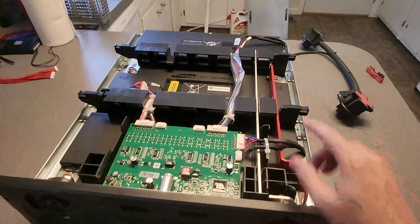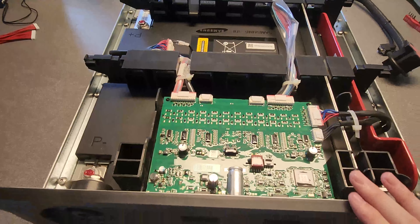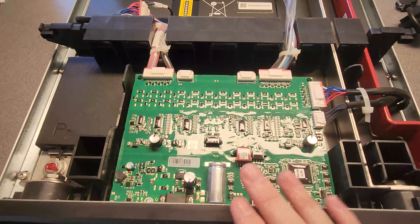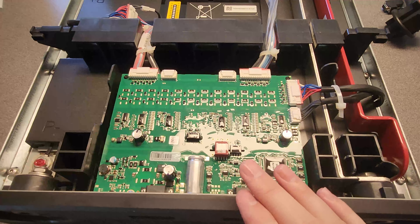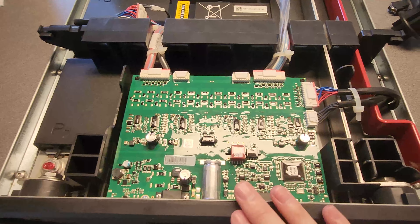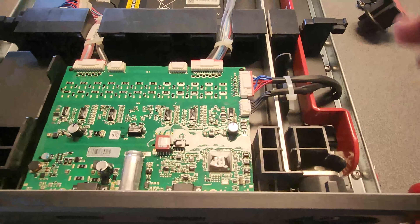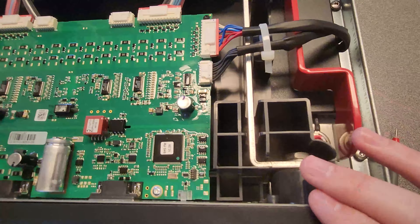I've confirmed all you need is those four screws up here removed and the two in the corner, and that gets the cover to slide right off. We have access to the system. Here's that PCB, which is probably their internal battery management system. There's no contactor in here, so this just probably handles balancing and monitoring. Here we've got our positive, it goes all the way back here. This bus bar connects the batteries — if you measure off that post down there that's only 30 volts, but if you measure here that's the full 95.